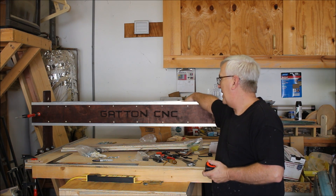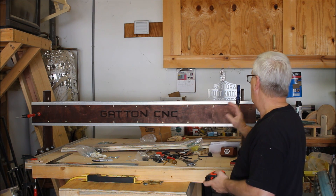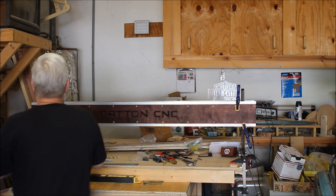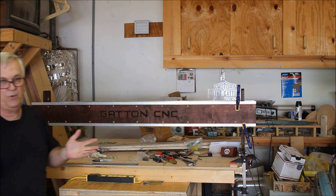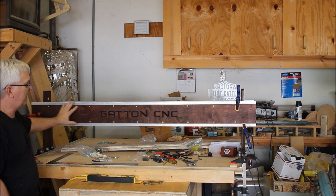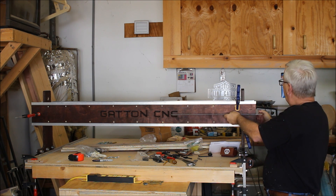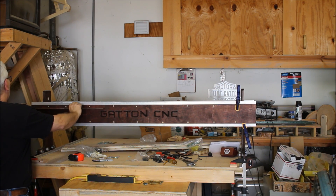I've got the two — the front and the back — on. I don't have the top and the bottom stuck in there yet, but I just wanted to show you the process. I made sure that the uprights were perpendicular to the table, so I've got these clamped and squeezed against this upright here. I put the first one on — the front one — and then I checked what distance I needed on each side. When I measured from this surface here to this outside edge, mine is right at three inches. I put it on, left the clamp a little loose, and was able to tap it back and forth until I got that one exactly three inches on each side, so that I know this front rail is centered. Next, I took my big carpenter square and set this other one on, clamped it loosely where I could move it, held this on here, and then was able to pull this back until I know they're flush this way, and they are flush on the other side as well.